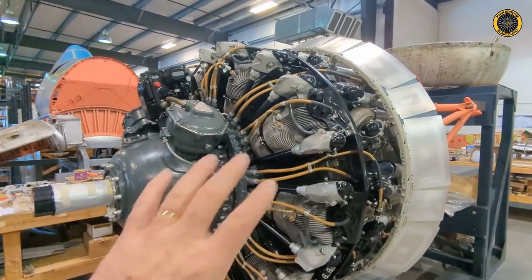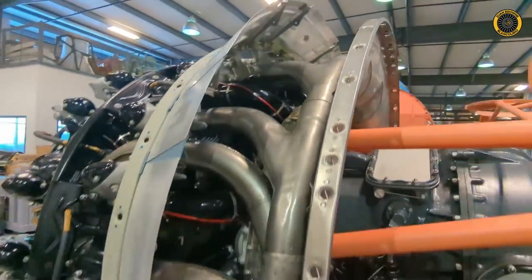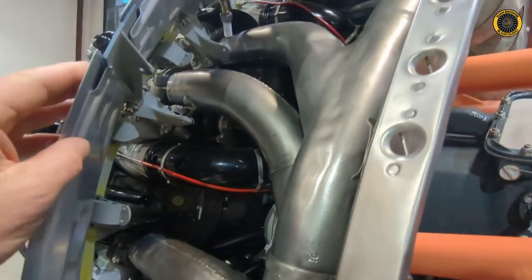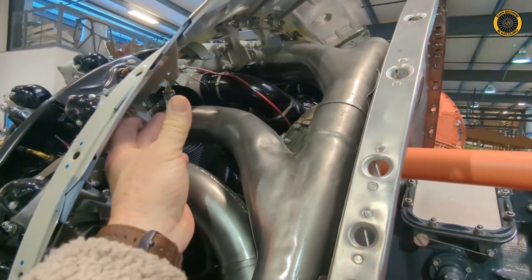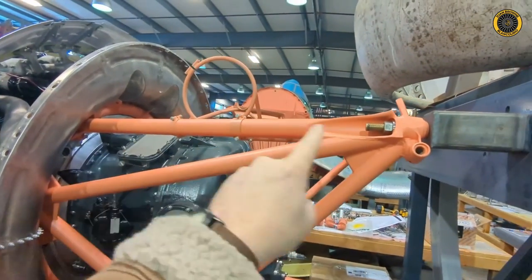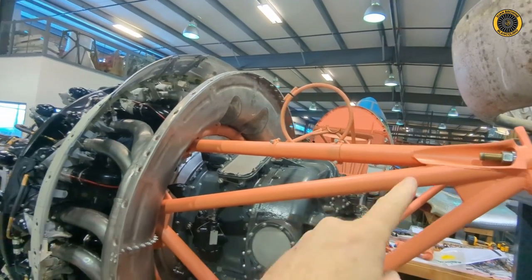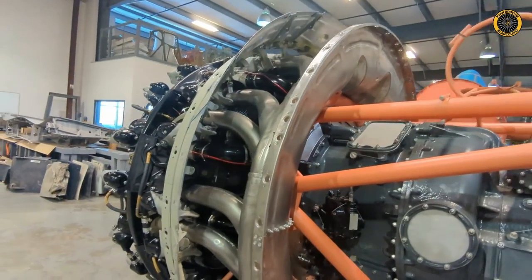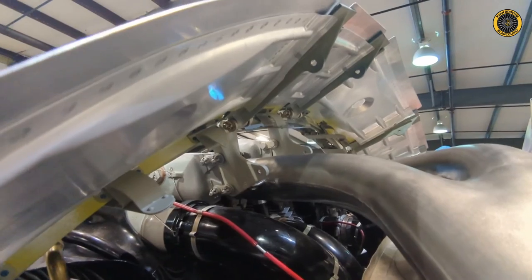The radial engine is an air-cooled engine, tightly cowled, and you control the air cooling with these cowl flaps. On the birdcage Corsair it has a lot more cowl flaps, which these guys are building from scratch. They ran individual little hydraulic actuators for each cowl flap — a complicated little hydraulic system to open and close them. On later model Corsairs they ran a single big pump and a series of pulleys and cables pulling the cowl flaps in and out, and if that failed the cowl flaps would automatically slowly open to cool the engine so you wouldn't cook it in the event of a hydraulic failure.